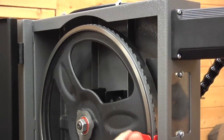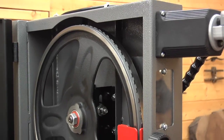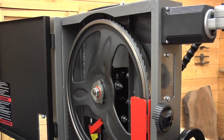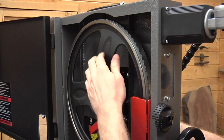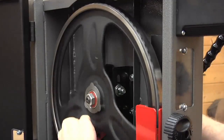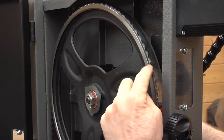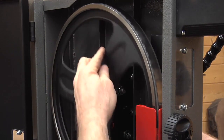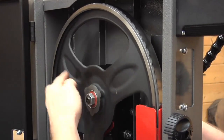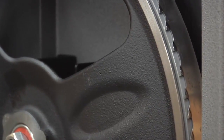It's important when doing this setup, especially the first time, to set the tracking by hand — spinning the wheel by hand, not with the saw running. If the wheel is really badly misadjusted and you start the saw, it might shoot the blade off. So let's do it by hand. I'm going to walk the blade forward, watching through the window, spinning by hand, and gradually turning the knob to move the blade forward. I've gone a little bit too far, so I'll walk it back just slightly. That's pretty much right on center — I like where it's sitting. I'll re-lock the lock knob and we're ready to go.